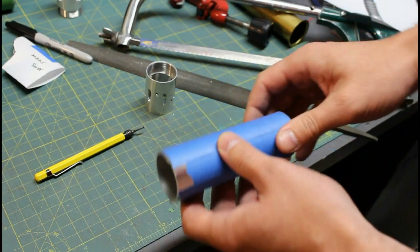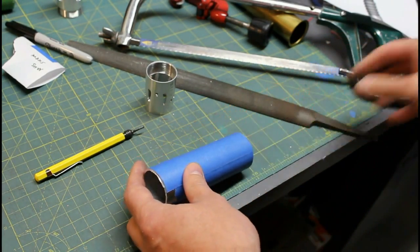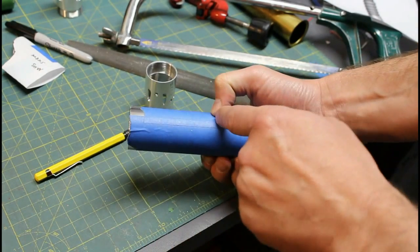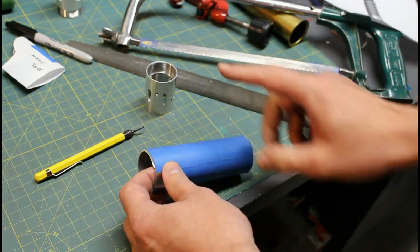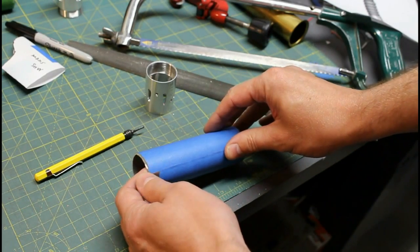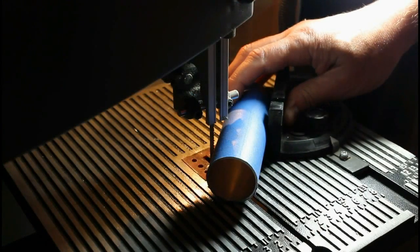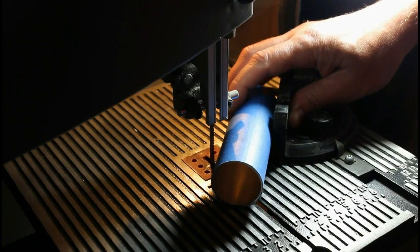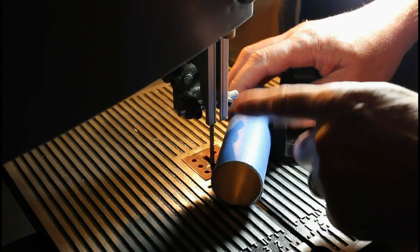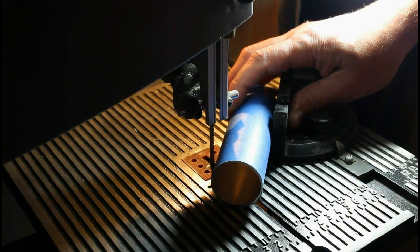That's not what I'm doing — I'm going to do something a little bit different. A miter box isn't really helpful here; this would be a tricky one without a miter saw. What I'm essentially going to do is cut a 45-degree angle partway through this piece, and then from that draw the rest in. Obviously once we cut it we're going to need to do a lot of sanding and fine-tuning — this is a very labor-intensive job, but if you take the time and get it right you'll really be happy with your result. Rather than use the miter saw I'm going to do this on my band saw instead. You probably don't have one at home, but if you do have access to a band saw with a proper blade, it can be a way to cut curves in shroud material.